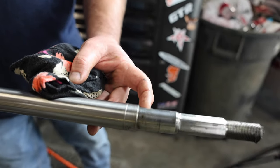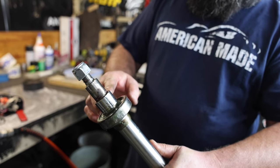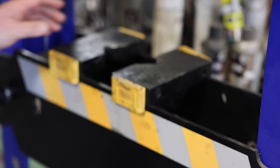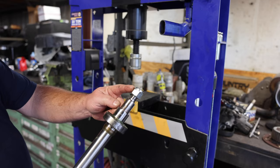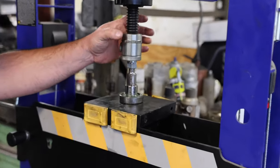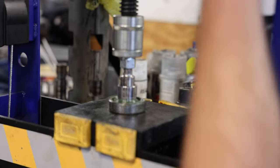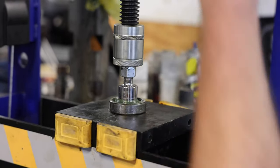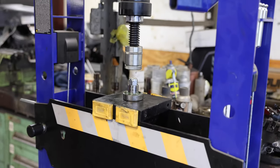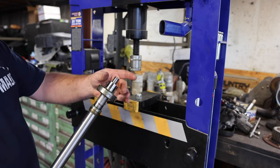Now is the time to inspect and make sure the shaft is good underneath the sleeve and bearing. Now we are going to remove the front seal sleeve and the old bearing. On a shaft press, use the old nut. Press the shaft down through the old bearing and sleeve. This is also a pressed fit — it will not come off easily. Once you have pressed it through, remove the nut, then remove the old seal sleeve and bearing.